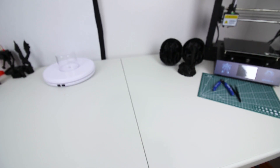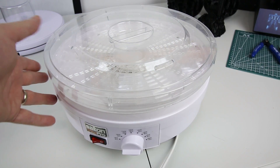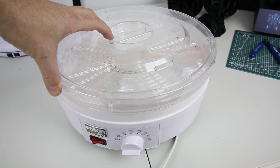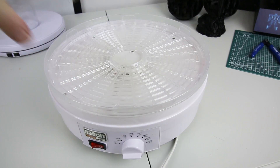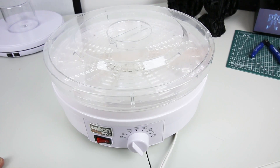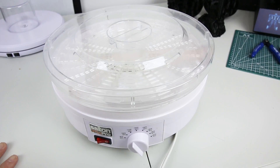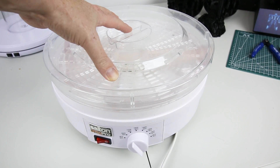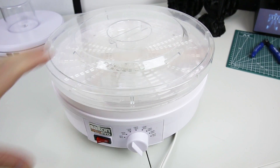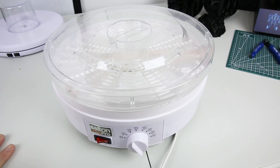If your filament is already wet, by far the easiest solution I've found is a food dehydrator. You can pick these up at Walmart for a reasonable price, or at thrift stores — people ditch these all the time. Just put your filament in there, set the temperature fairly low — I run mine around 115°F or thereabouts. It's not going to hurt the filament at that temperature, but you don't want to distort the spool. Let it run a few hours and test it out. Some people dry filament in the oven — that's risky and I don't recommend it. Alternatively, put your wet filament in a sealed tote with desiccant and it will dry out over time, just a bit slower.